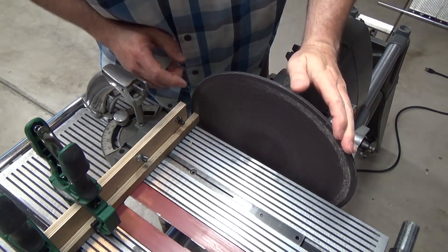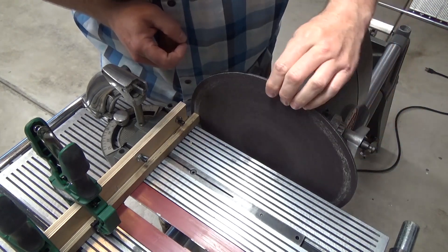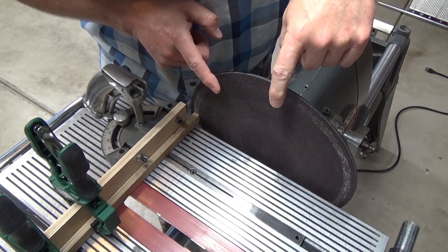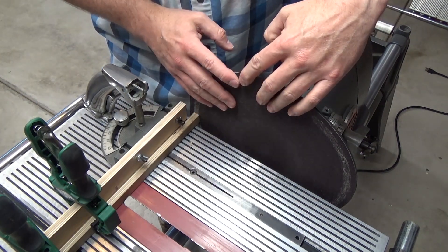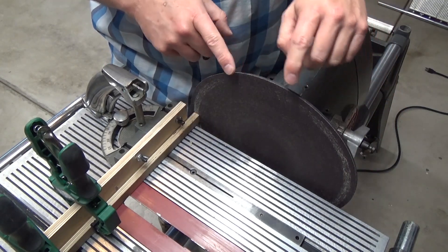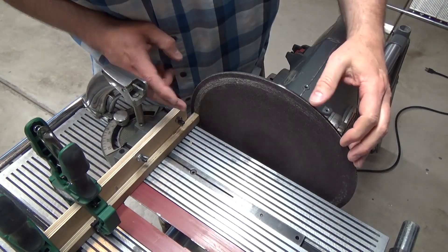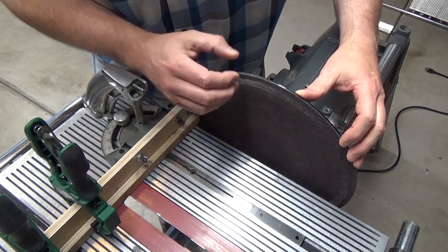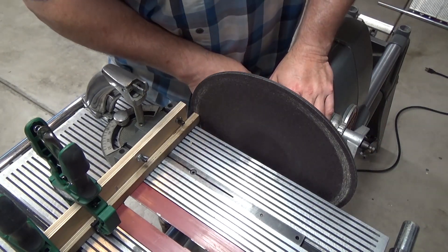We have some small low spots here, and then 180 degrees of that, a low spot here. That could either be where the abrasive disc itself varies in thickness, or there could be a slight dish in the disc. But because I'm getting pretty much symmetrical wood debris collected all the way around, I think that's an indication that the shaft has very little run out. This degree of run out on the Mark VII is not going to work, so I contacted Shopsmith with my problem.